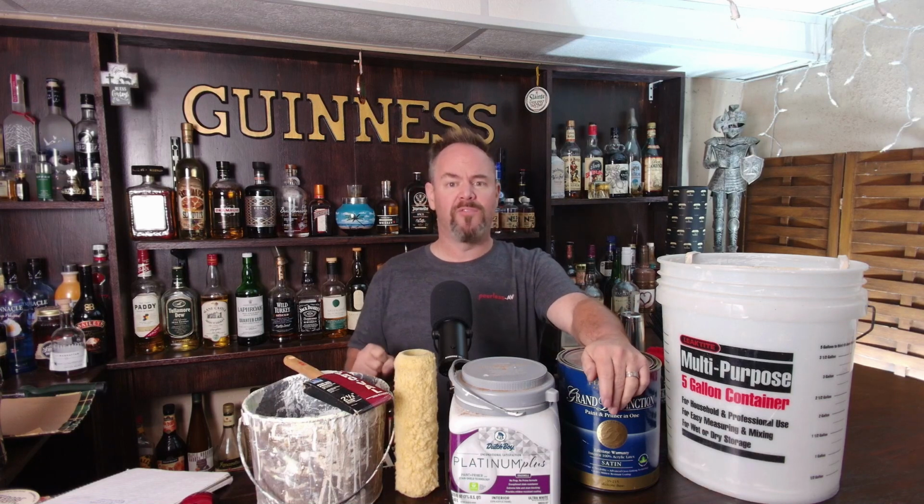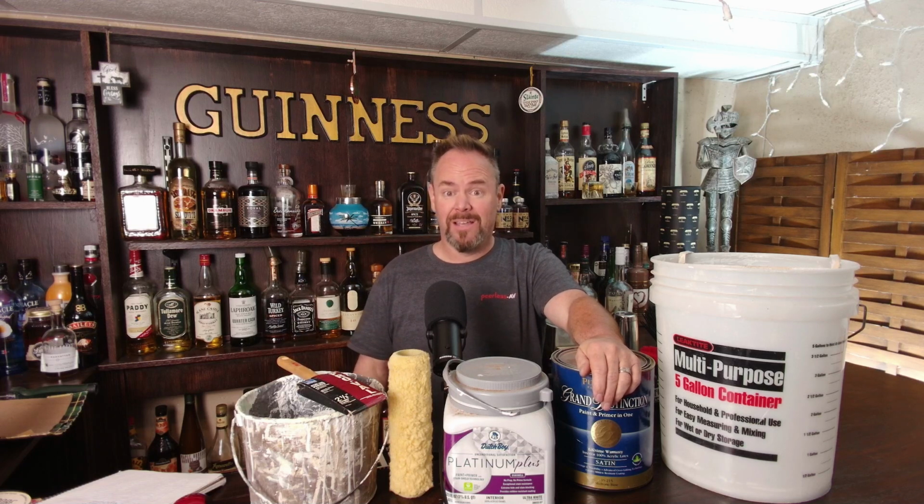Because if you remember from the previous episode, I said that the whole point behind having a coating was to protect the walls, not just make them look nice. So you want to make sure, especially if you're doing a bathroom, that your bathroom is completely sealed. You're going to have that moisture, that humidity. Whenever you're taking a shower, you have standing water in your toilet, or you're using your sink and things get steamy, that humidity is going to rise up. It's going to attach to the walls. It's going to seep in if you don't have the right protective coating on your walls.